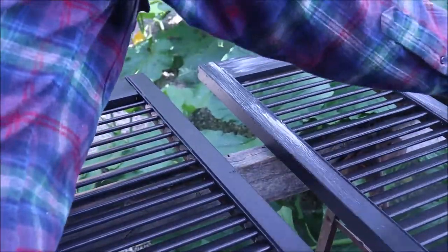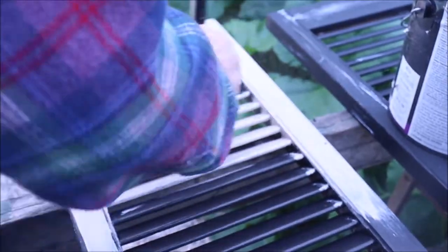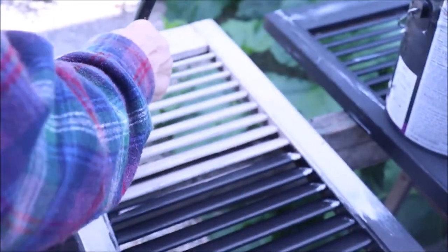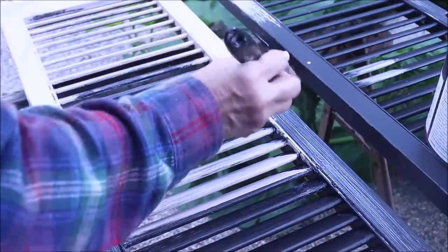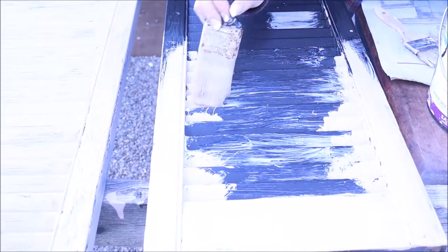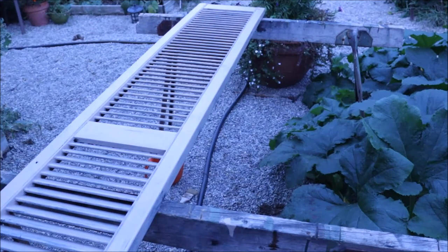While we're putting the glue on, we're going to wait until it becomes a little bit tacky — almost dry, not completely dry. When we get to that point, we come back in and paint with our top color, which is the same color I used on the workbench and on our sheds — just using up more of that paint. This doesn't have to be perfect because we want some of the black to come through and some of the glue to make a big crackle or a small crackle. While this technique didn't give me the bigger crackle I was expecting, I think it turned out lovely. I just love the rustic look. Work in small sections — glue on, let it dry, then paint on the paint — because it does dry fast. I'm already getting the perfect crackle, very rustic, and I'm very happy with how this has turned out.